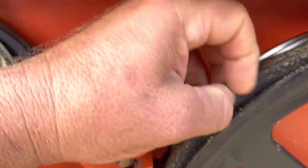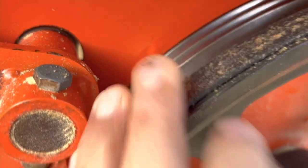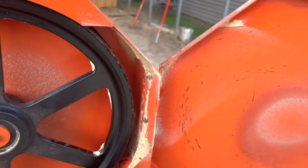We've been taking these off and cleaning them because sometimes that pitch will get built up underneath there. I seen on Facebook the other day, somebody was wondering why that was building up in there. A lot of your problems when you're cutting pine, it's got a lot of pine resin. And when you run water and soap, once you get that sawdust wet, even with that soap on there, it builds up underneath this belt, which it ain't supposed to. It's supposed to sling it out, but it does. That's one of the reasons why I run straight diesel. Diesel takes care of that.